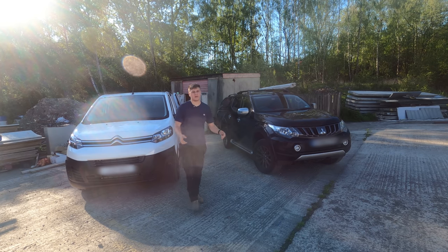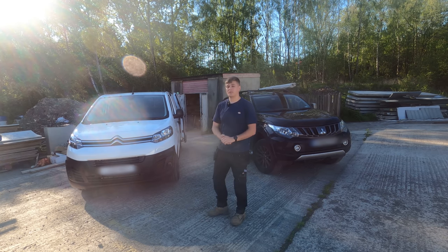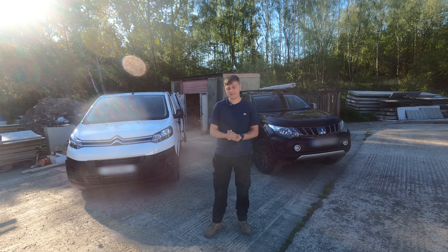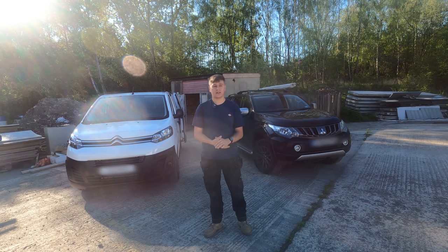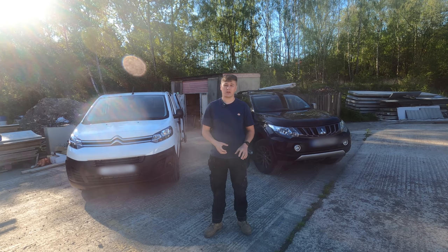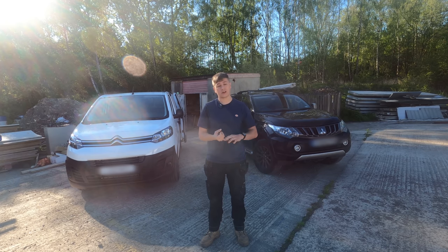So we're back at our favourite place, the industrial estate. We're all done in the units now, so we are in this mains room. We're doing a 630 amp Hager MCCB panel, 185 parallels feeding it, 9-inch trunking, CTs on all the outgoing ways and the incomer, loads of cool stuff. So yeah, going to show you properly the trunking today, prepping the board, building the panel, all that sort of stuff.